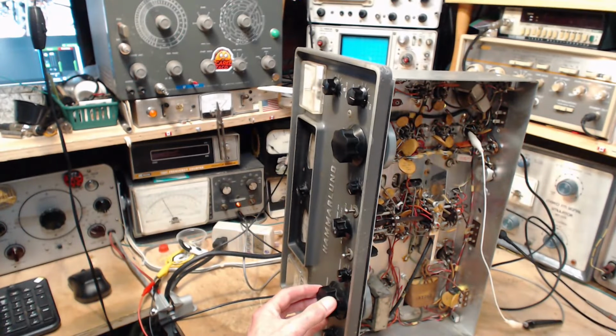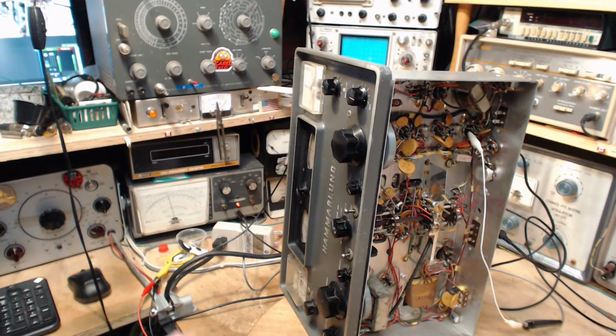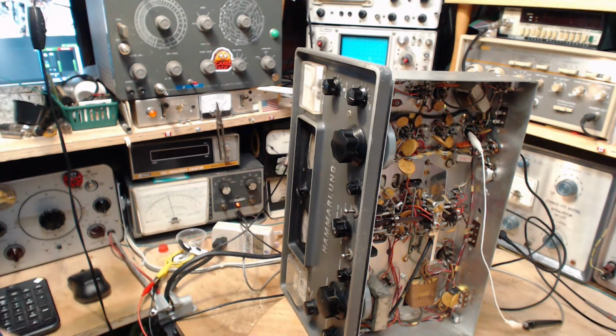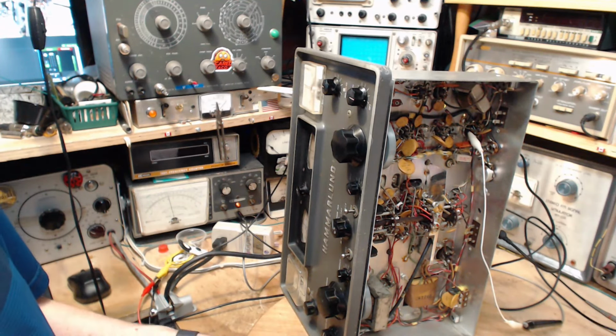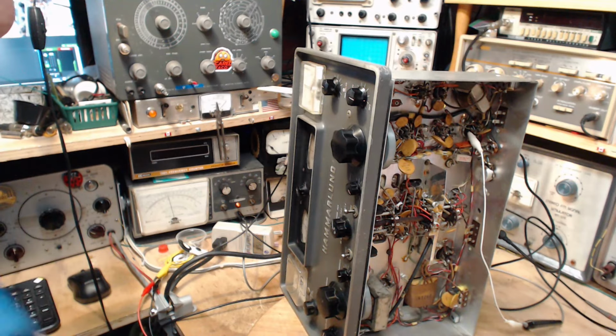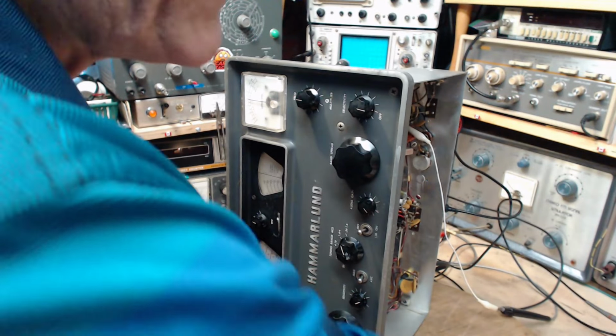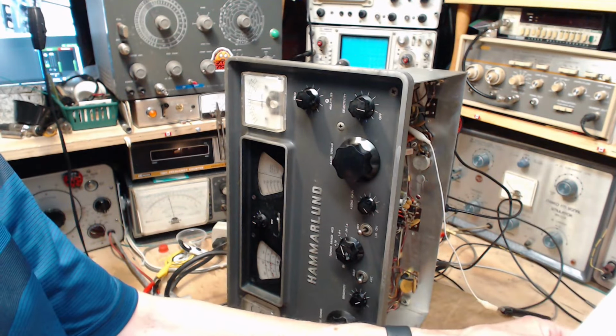Maximize using the radio tuning. And then I look at it and I say, it's a fraction off, 1.2. It's a needle width or a pointer width, so that's good. Now what are we doing here? We're adjusting the antenna, doing it with a signal generator. Oh, we'll make sure I get the top and bottom slug thing correct.